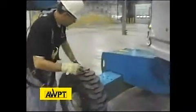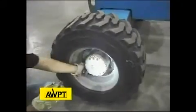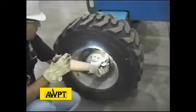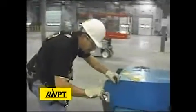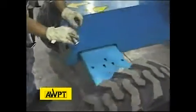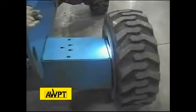We come over here, we have another wheel, looking at the tread, the sidewall, the lugs, loose or missing parts, just giving the lugs a visual inspection. Air pressure, we have sufficient air pressure. Looking for leaks inside the tire, for a worn drive motor seal or something that may have been wrapped around the spindle. Looking in here for debris that doesn't belong, that could have fallen in while the machine was being operated, ensuring the swing lock pin is not engaged. Looking at the cylinder to make sure that it's not leaking, or all fasteners are in place.